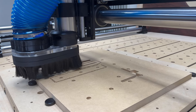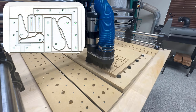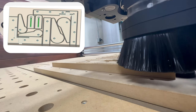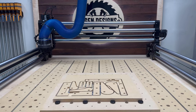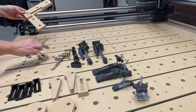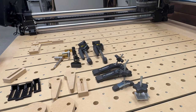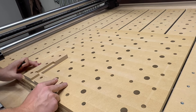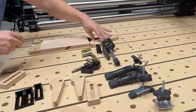You can also design and create your own accessories, and then you're only bound by the limitations of your own creativity. For this particular design I'm doing a few L-brackets, some cam clamps, and a variety of bracing options, all designed to work with the lattice of threaded inserts in the spoil board. One of the most useful is this L-bracket with an inset for your touch probe - it provides a consistent registration point on the spoil board, so if you're batching out the same project over and over it gives you a place to register the corner of your stock the same way each time. You can also install this on top of the sacrificial board.